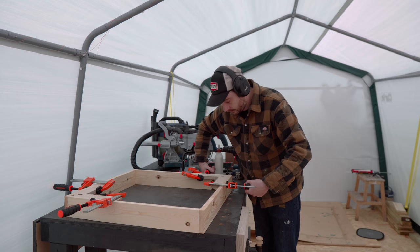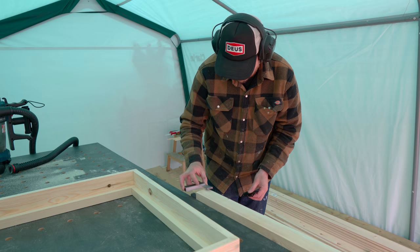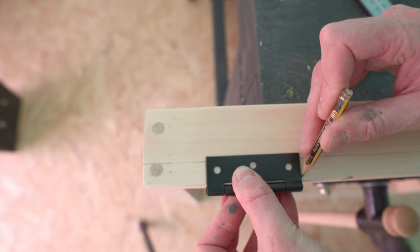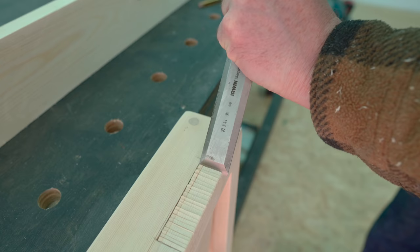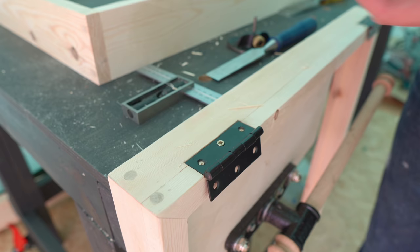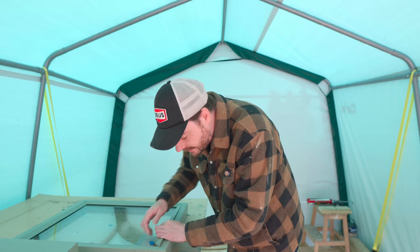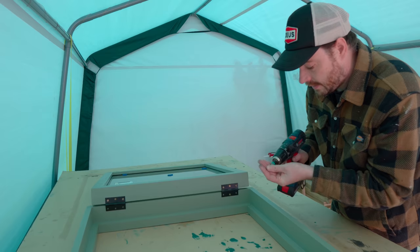With that part done I need to make an outer frame to go around it, so I get that done exactly the same way as before and leave it clamped up to dry. For the opening window I've got the two parts together — they need painting, but before I do that I'm going to get the mortises cut for the hinges. I get the positions marked out and chisel away all the waste. Then I skip ahead, get them painted, and get the glass in. With the paint dry and glass in, the last of the beading goes into place and I can attach the two parts with the hinges.